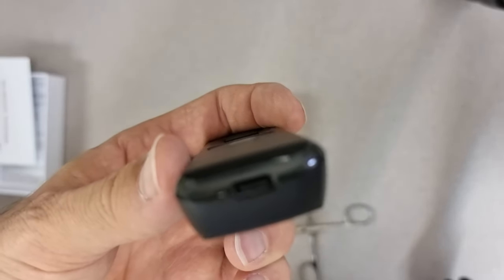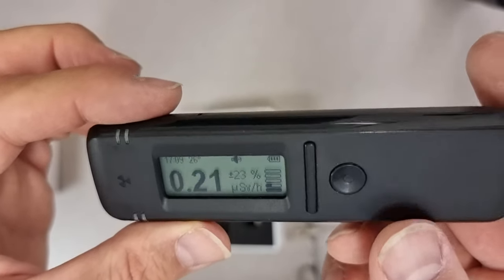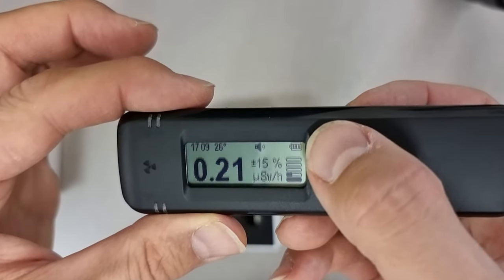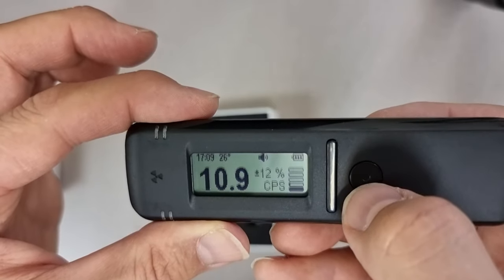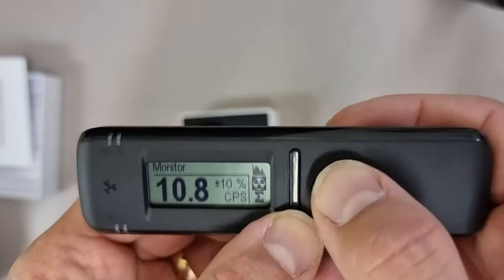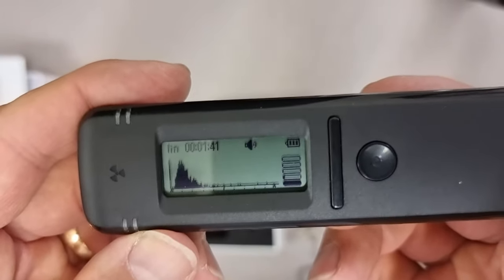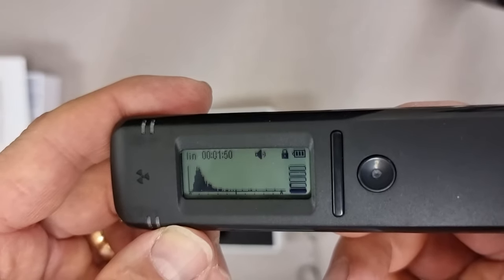The device is fairly weighty — I think it's got a rechargeable lithium-ion battery. It's USB-C, which is really modern. When you turn it on, it's got clicks and a little sound. You can change between counts per second and microsieverts per hour. You've got a lock mode, and if you press buttons together you get a summation view and then a graph. There's a spectrum mode — look at that! You actually get a spectrum right there on the LCD. That is very nice — you can get a guide for what's going on.